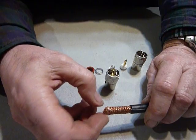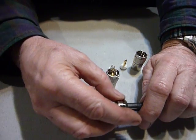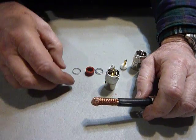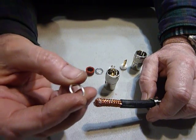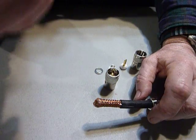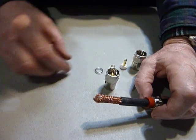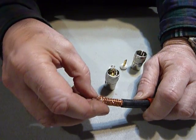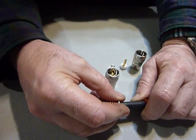You've got it back an inch like that. The next thing - first of course you want to be sure you've got your compression nut on there already on your coax. Then you get your compression nut on there, and then you put your compression washer on - that goes on after the compression nut. This one has a bigger center hole inside diameter than the other washer that goes on next. Then the next thing that goes on is the rubber compression bushing - you push that on, and then you have the compression washer that goes on right there.